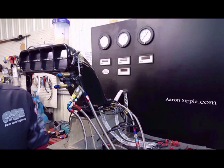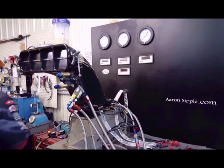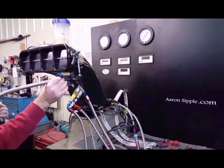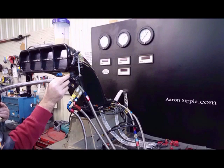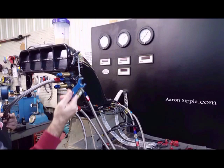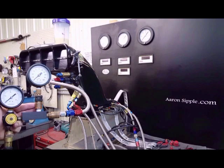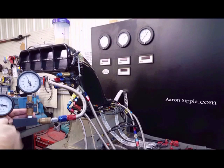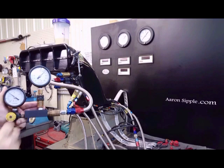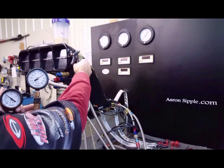Blown alcohol and naturally aspirated motors have the barrel valve set up a little differently. When you flow your barrel valve you want to block off your idle check valve, which is right here. Some guys run them blocked off, some guys run them — it's also known as your pump saver. Let's flow this one. Put your first gauge on 100 and read the second gauge. Right now, as an example, I'm showing you what a naturally aspirated motor would be set up at.